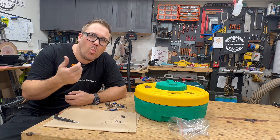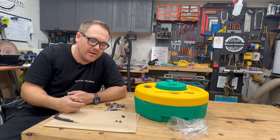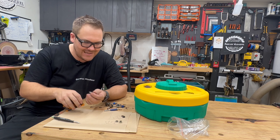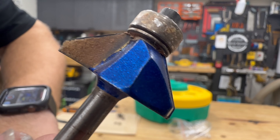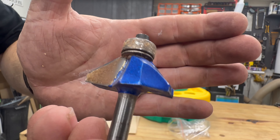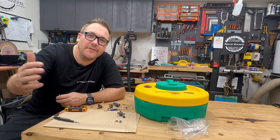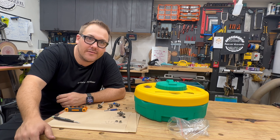You may be thinking: why clean the blades in the first place? You may have just cut a huge piece of hardwood last week and you don't see why not. Well, this is why — when you don't clean your blades, they end up with huge deposits of dirt and grime built up right on the cutting surface. That dirt and grime leads to a build-up of friction against the timber and a build-up of heat. Heat will dull your blade really quickly, and you'll find that the bit you're spending lots of money on isn't cutting so great a few months down the track. That's where the Microjig Blade Clean system comes in and saves you lots of money.